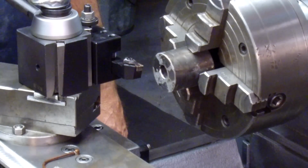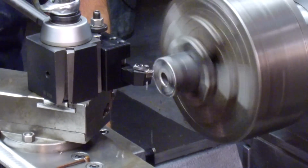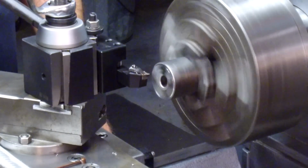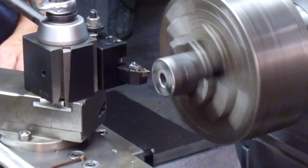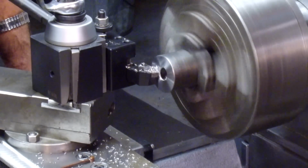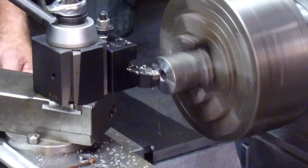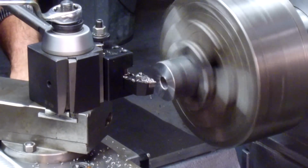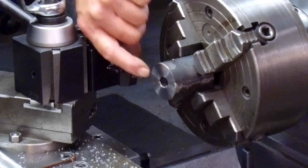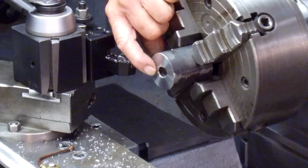All right, we put in our small CNMG insert here, and we're going to go ahead and take a face cut here. We'll come over here and we're going to touch. All right, and we'll take about 10 thousandths off of there. And that solder joint looks really good, and this is a nice finish. The seam line, or the split line, looks really good.